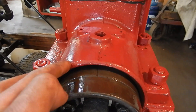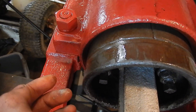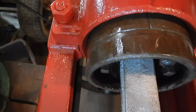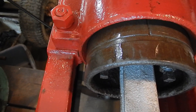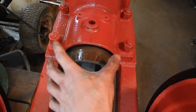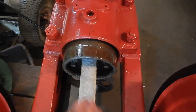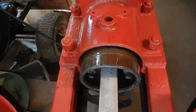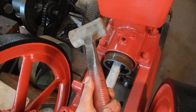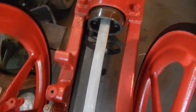A lot of hit-or-miss engines, at least the ones I've worked on, have a chamfer at the base of the cylinder. That allows you to not need a piston ring compressor to get the piston in — you just insert the piston from the back, gently wiggle it, maybe squeeze the rings a little with your fingers, and that chamfer will funnel the rings right in. I had a little help from a dead blow hammer — really handy thing to have around. You can really beat on something and you won't damage anything, you won't even damage paint.